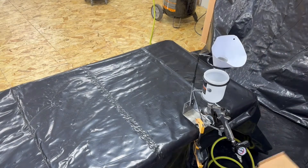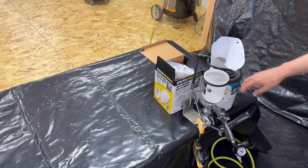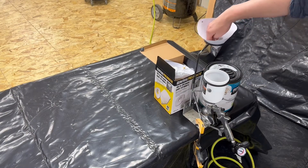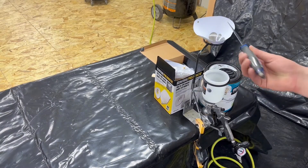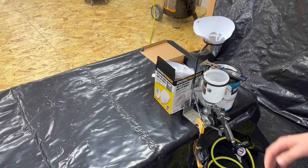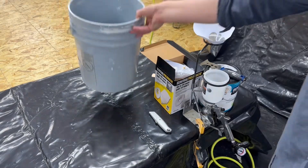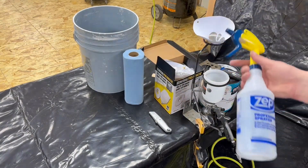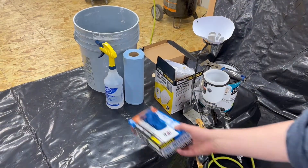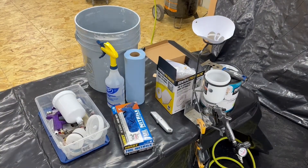Your filter — and you keep more filters right behind the gun. Then to the right of the gun in its stand I keep the bucket of paint, that way you can just move this guy over. Plenty of paint sticks, a painter's tool for really just opening and closing the can of paint, a razor blade because you never know when you're going to need one of those, a five gallon bucket for throwing away stuff, shop rags, a spray bottle of water, plastic gloves, and a spare box of HVLP parts just in case I need to clean it out or replace something in a pinch.